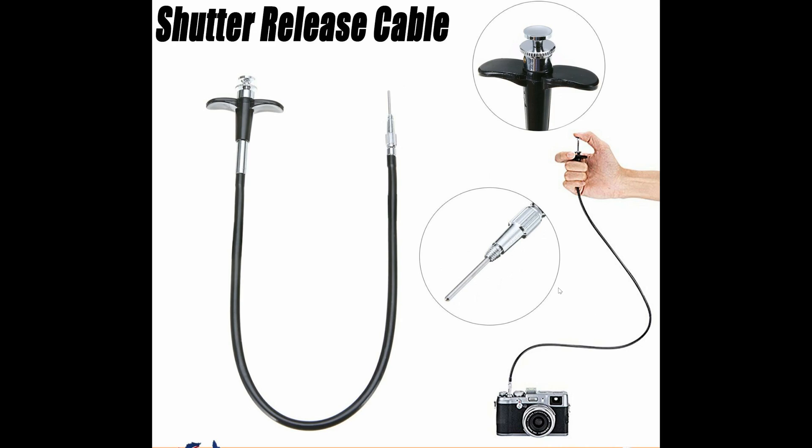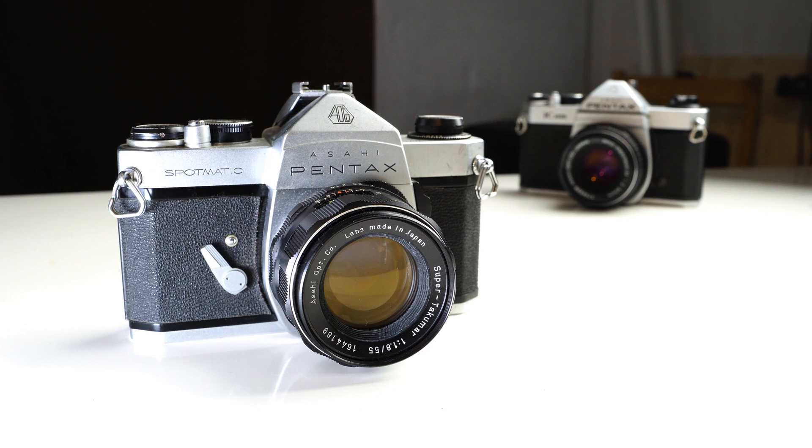For old film cameras you have a couple of options to take a picture without being behind the camera. You could use one of these manual shutter release cables — the longest one I could find online was around a meter long. Or your film camera might have one of these self timers, similar to a timer you can set on your smartphone for group shots. My idea was to make an electrical circuit using the Raspberry Pi Pico operated by an infrared remote, in order to take a picture with the old film camera. I also wanted the design to be somewhat portable, so for a power source I'm using a portable power bank for a 5-volt supply, which can pretty easily be mounted to a tripod.